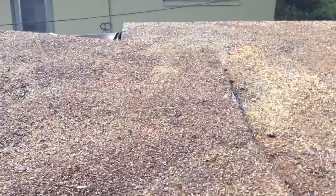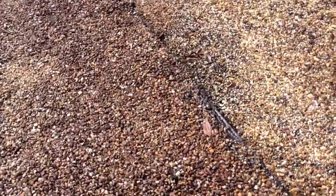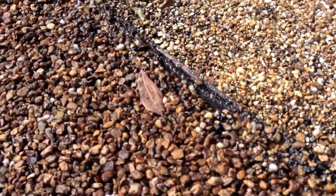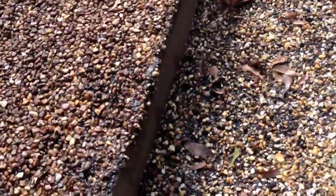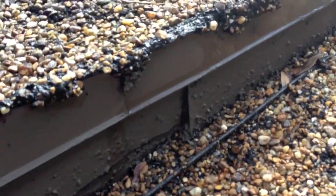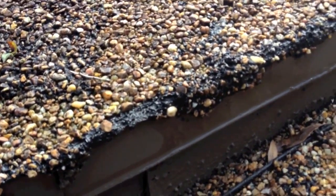This is a low slope roof. Over the carport area there are also some repairs that have been made. You can see in this area that the metal eave drip and gravel stop are retaining water. Stepping down onto the carport, there appears to be a separation in the metal flashing which can lead to water intrusion. You can see the asphalt has been gooped over the gravel stop.